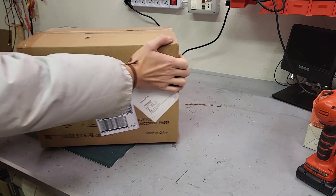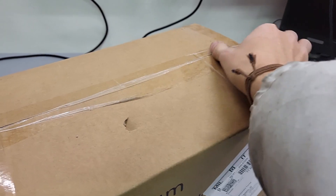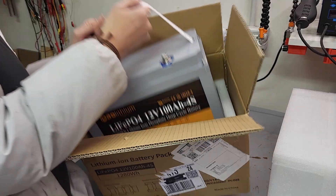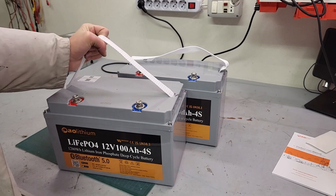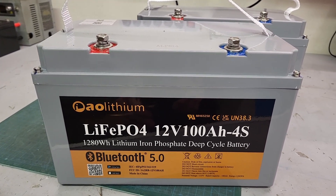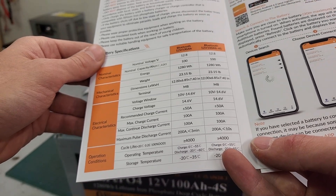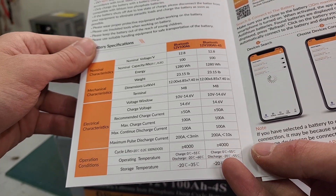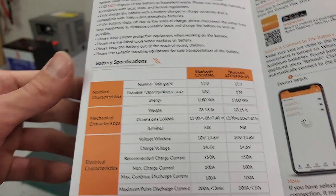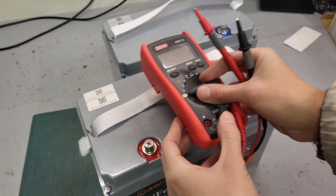For a big project like this you need a battery — and actually why not two? I chose two 12V 100Ah lithium iron phosphate batteries for a total of 2.4kWh. This type of battery has the unique feature of supporting deep discharge with over 4000 cycles, even at 100% discharge. They are the most expensive components of the entire project.